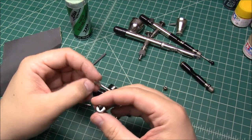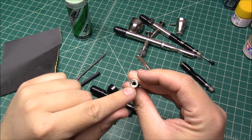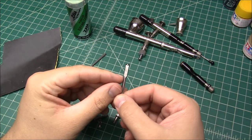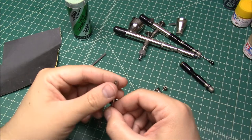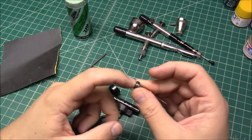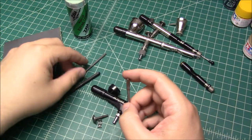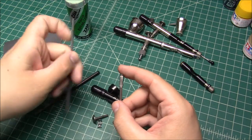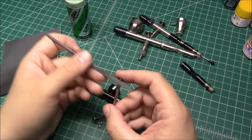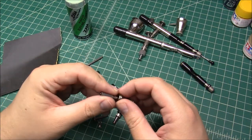It's either the machining marks on this flat, on this little face, or the machining marks on this face, on this flat. If they're rough, it'll cause some interference when you're doing the action of the airbrush. So you can do the same thing, either just with straight ZAM, with straight sandpaper, or as far as you want to, and just file down a little. Try and get those rough edges off, sand it, make sure everything's smooth, polish it up, and that's really going to help.